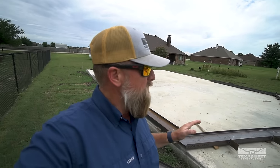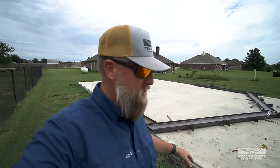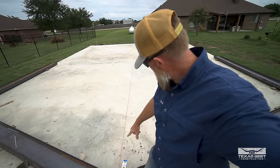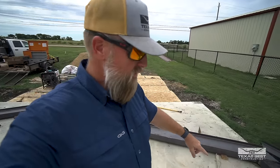There will be mainly three columns that will look like this that will stand up. We've got the first one fabricated, which always takes the longest. What we're doing here is a 14-foot eave height with a 4/12 pitch on a 30-foot span. You're gaining about 4 inches per foot, so the peak height is going to be around 19.4 feet. We've got our lines popped here on the center and they've already got this one pretty well ready to roll.